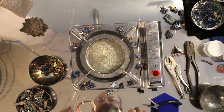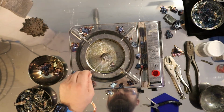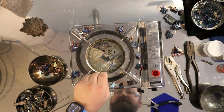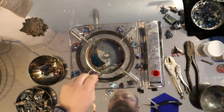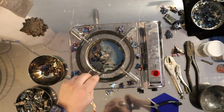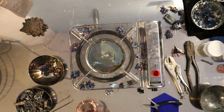We've got this molten again. We're going to try to not disturb the little wire here, just right there. We're going to skim around that and see if maybe the copper, even though it's coated with bismuth and bismuth oxide, sticking out of the melt will conduct heat away from the melt. So we know it's fully at the molten bismuth temperature, but if it cools off more quickly, it'll get a crystal going there first, and that will be interesting.